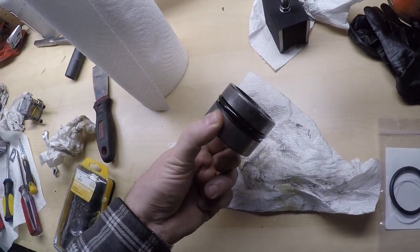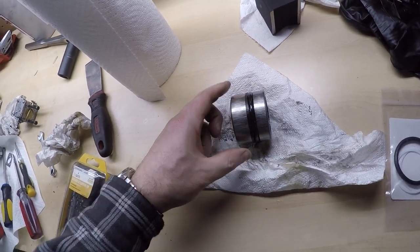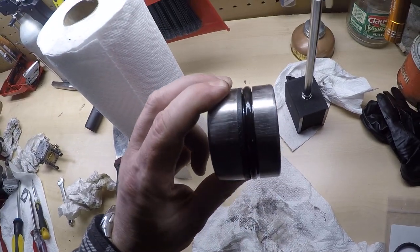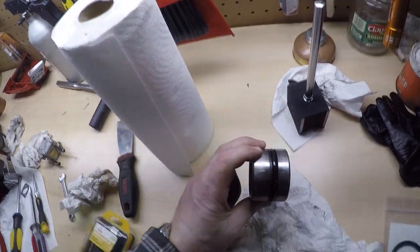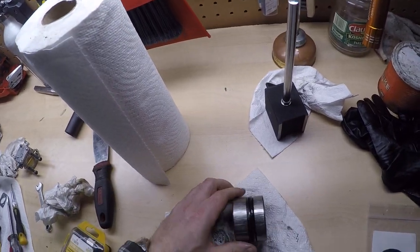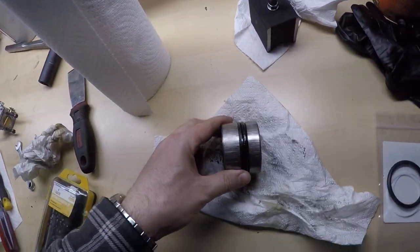It's no worse than the scoring that's on the piston. At first glance, it looks like the ring and the backup ring are actually in pretty good shape — they're definitely better than the one I pulled apart before, where the backup ring was mostly gone. But as you start to look a little bit closer, you can see how it kind of gets thin and flat, and you can see where it's flattening out and kind of rolling. So that's probably causing my issue, so we'll get those changed.